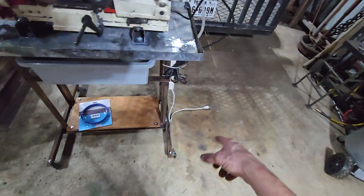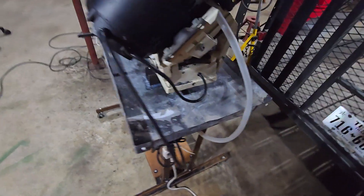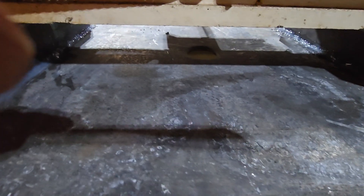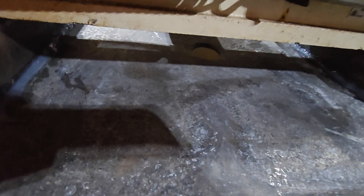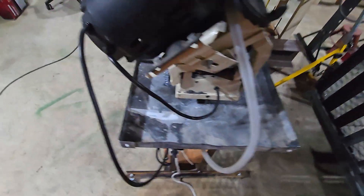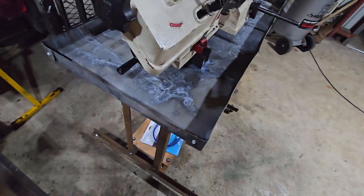I thought I had it fixed with just a tub sitting under it, but that didn't work well — it was dripping over on the side, as you can see the dampness on the concrete. So I had a piece of sheet metal laying around and I bent up a pan, used some square tubing as risers, siliconed around everything, and punched a hole in the center. I took a conical piece of metal and hammered it down in there so there's a lip sticking out the bottom, so when it drips it'll drip straight down into the pan and won't run along the bottom and drip anywhere else — kind of like a real short funnel lip.